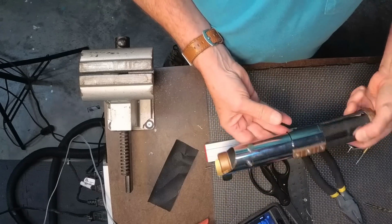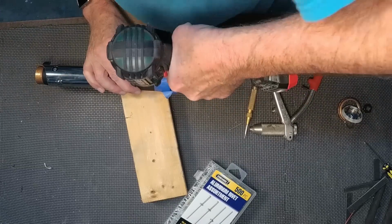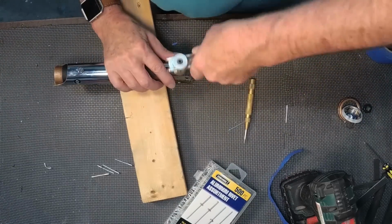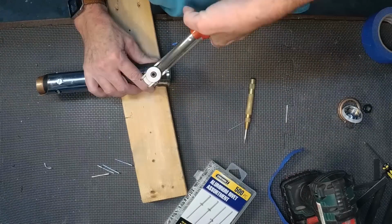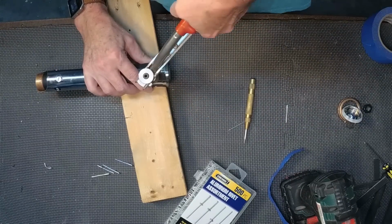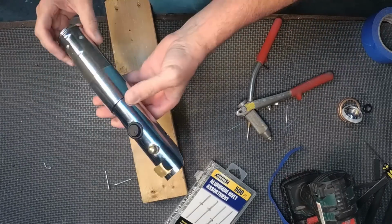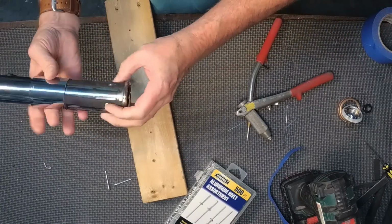That's going to work. Now I'm going to move back to the back of the hilt, because I noticed in the photos it looked like it had a rivet on each of those black strips. So I marked those, I came through and drilled them, and then just used short rivets to go around that.